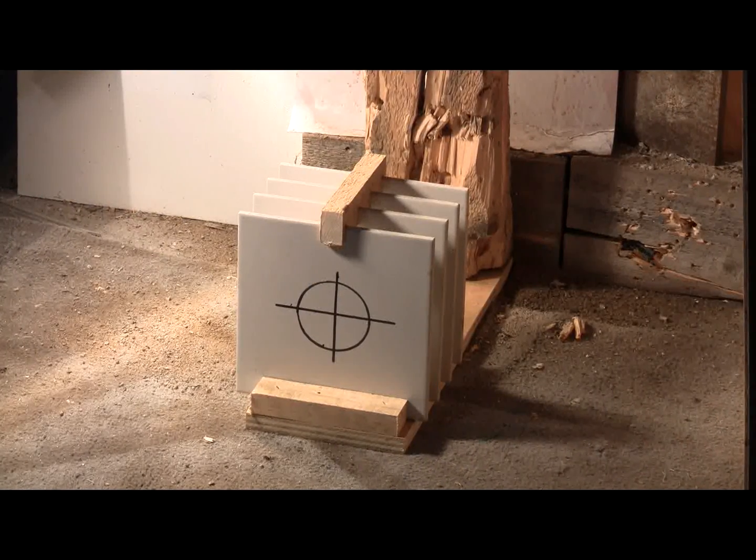Whipple Shield target, 400 psi, 80 grain glass marble, caliber 625, 72 inch barrel — and fire!